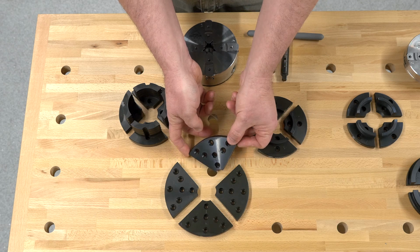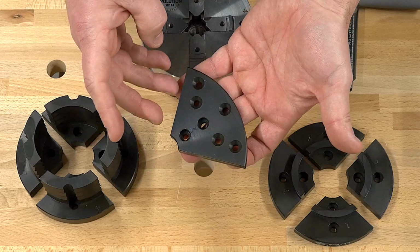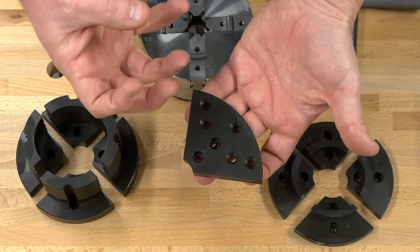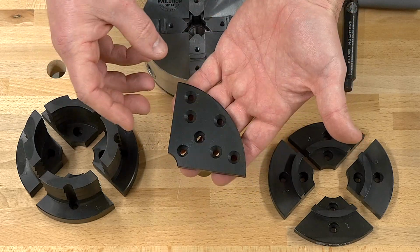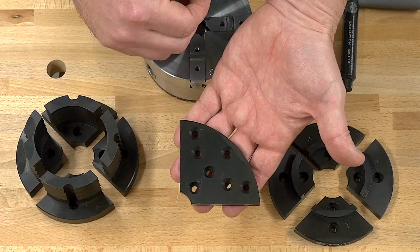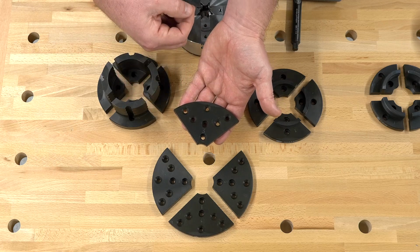Now these do need a little bit of explaining. If you've never seen a set of wood plate jaws before, they're very much like button jaws, wherein you make the wooden jaw to sit on top of here, which you can then grip the outside of bowls once finished, just to take the feet away, or any other application you think a wooden jaw will help with, either internal or external. The jaw, of course, can be made to any size, and generally with a piece of plywood is the best option there.